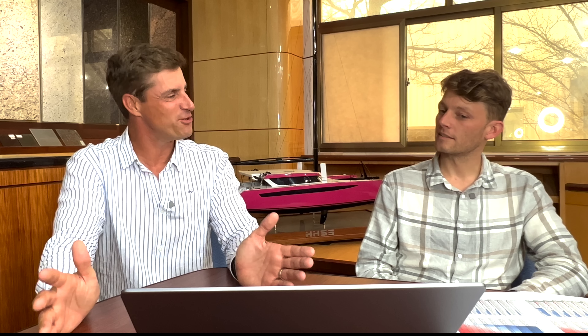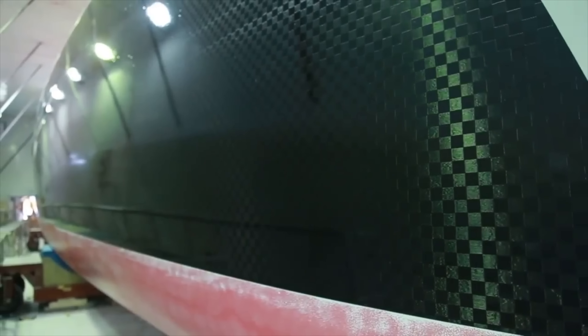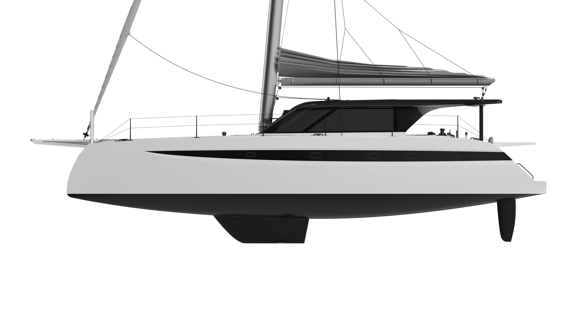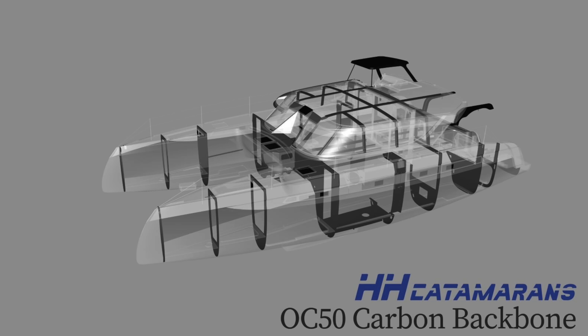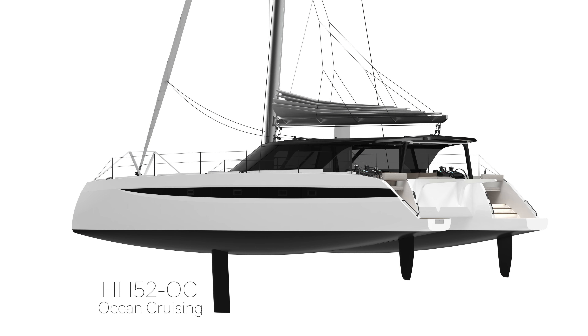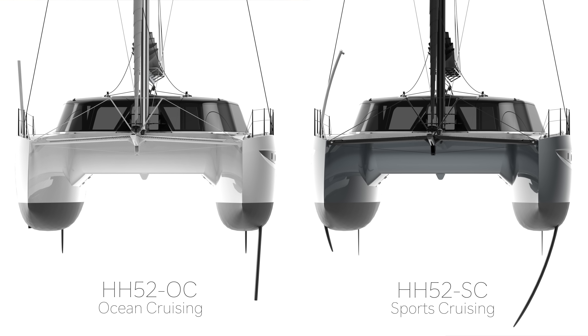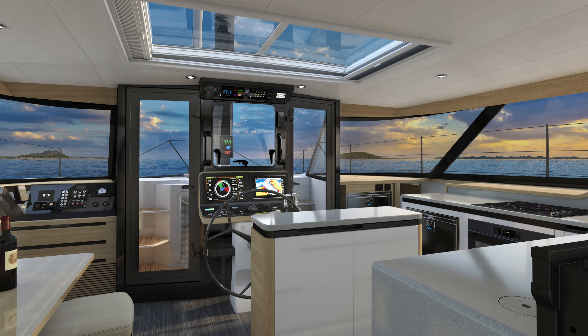The last thing is the OC and SC versions. We make both — we're known for our carbon construction that we really started with our 66, 55, and 50 in what we call our sports cruising models. They're all carbon: carbon decks, carbon hulls, carbon bulkheads. The OC ocean cruising version is geared toward more of a cruising boat, less racy, but still with a tremendous amount of carbon in all the bulkheads and structural areas. Big news as of yesterday: Paul, our builder and CEO, has agreed to do straight dagger boards on the OC 52 as well — a middle ground between the big curved pre-preg carbon boards and a fixed keel. So you can get an OC or SC version, and we do have both the aft swing helm version and the forward cockpit, which we'll go into in the next video.